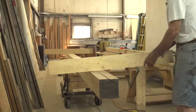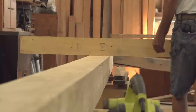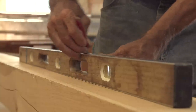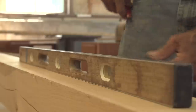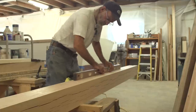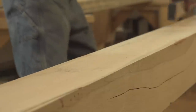It might be perfect on one end but not in the center of the timber, so you move the other piece down and check the whole thing. Here's a trick you might have seen me do before: I'm going to use my level, the aluminum part of it, put a whole bunch of lead on there for my pencil, then flip it over and rub the timber with it. What it does is show you exactly where all the high spots are. It's just another extension of trying to get it even better and better.